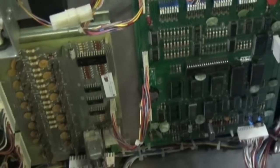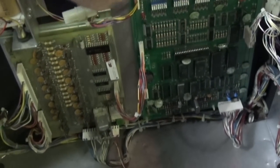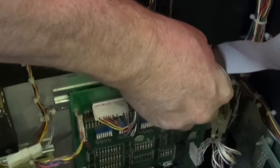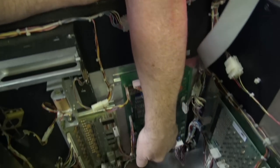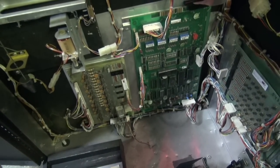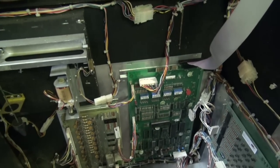It's a super clean board, as nice as can be. Now, it doesn't use this connector, see? But this one here is the display connector — that fits on nice and tight. You have to make sure that's in tight, or your displays will go out. And this connector here is also not used. We figure in other games — the full-size pinball machines — they use these. So not everything is used because there's a lot less on this cocktail machine.